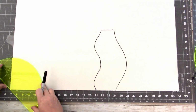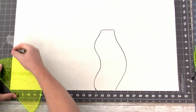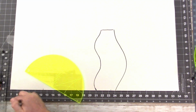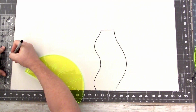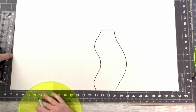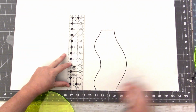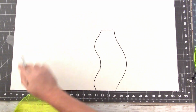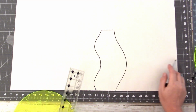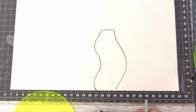for where the next ones start, which they start at 5.5 up from here, so you would put your 5.5 mark for your line. And you could use the line minder to make sure all the way across that you're even. But basically you're going to get your 5.5 tick mark here and create your chalk line or whatever you're using all the way across there. And just do the same thing. Mark your 5.5s and then you'll stay on. Okay, so that's one way to do it.